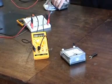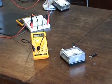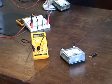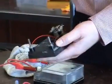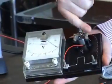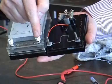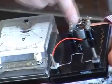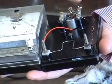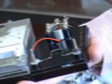Finally, it might be interesting to look inside a disassembled ammeter. All it is: current comes in here, goes around a little coil of wire which has a magnet in it, and back out the other side. As you put current in, the wire becomes a current-carrying conductor in a magnetic field. A current-carrying conductor in a magnetic field experiences a force, and it deflects — the greater the current, the greater the deflection.